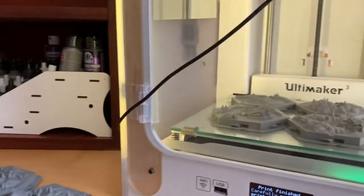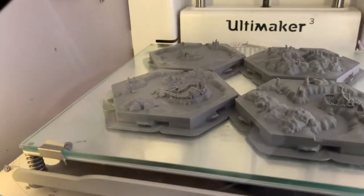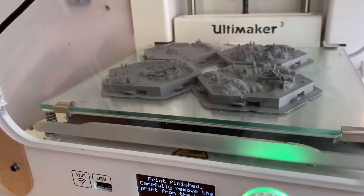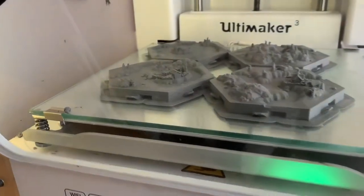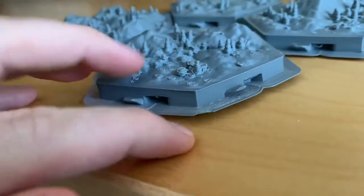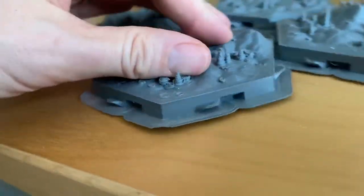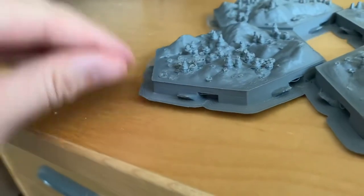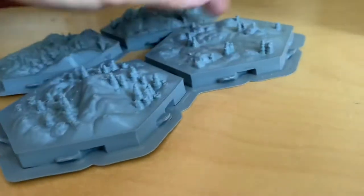Here are some tricks I learned with printing, especially on a glass bed. A lot of FDM prints on a glass bed are really affected by temperature. Here's an example of a previous print — you can see on this flat surface there was warping. One side came up off the bed, everything got a little compressed, and it's not perfectly flat on the bottom. The other sides are pretty good, especially on this side, and that was really due to the glass bed.